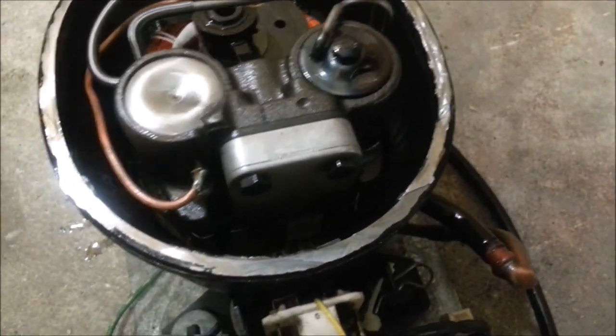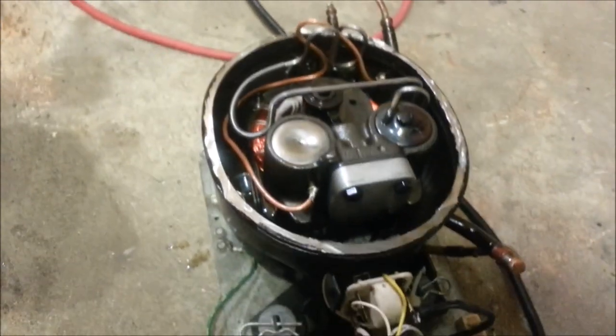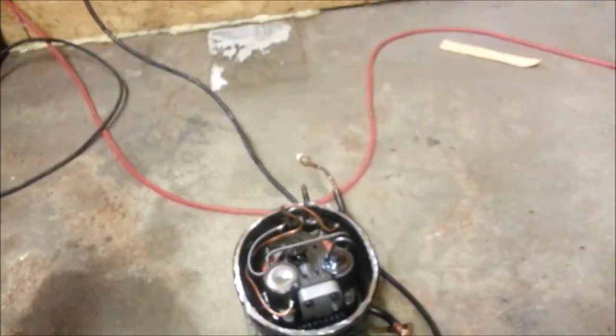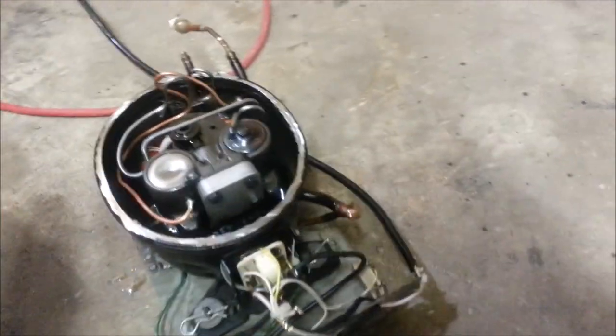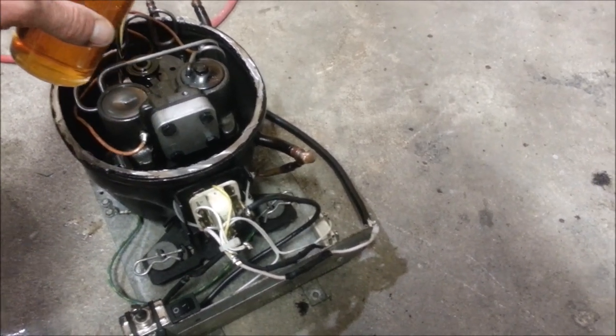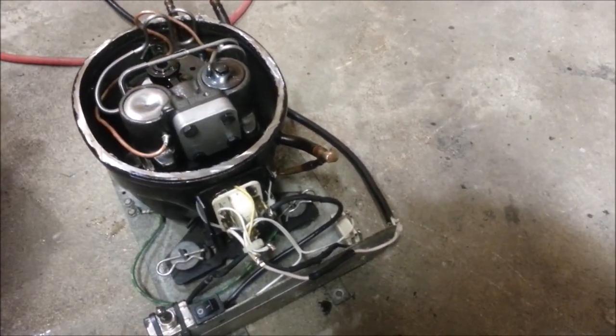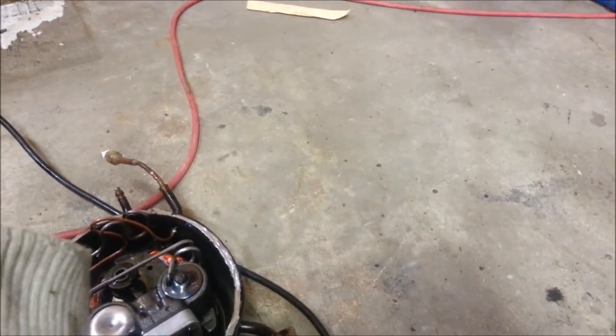But that's not what we want. You see it kind of dripping around there — I'm sorry, I probably wasn't even on it. So I'm going to add another 5 ounces. 8 ounces is a cup. I told somebody to put at least one cup of oil back in one of these, so I'm going to dump another 3 ounces in there, because that's what I put back in mine the last time.